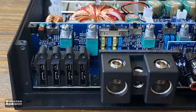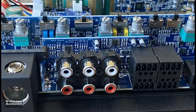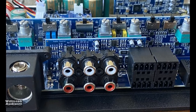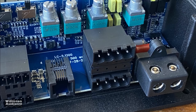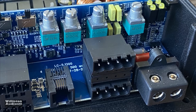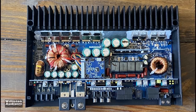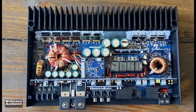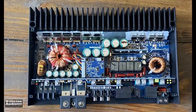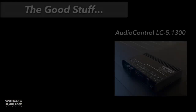These are bespoke design amplifiers designed by Audio Control — you won't find another amplifier that looks like this. This unit is Rev 2.05, made in 2020. You can see all the daughter boards standing up for the inputs and crossover controls, the RCA inputs — I wish they used Tiffany-style or panel-mount RCAs. You can see all the different connections, potentiometers for level and crossover controls, the transformer on the left side, capacitors, resistors, and daughter boards all over. It's very well laid out and put together by Audio Control.